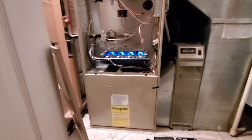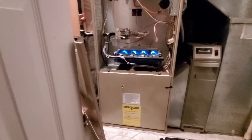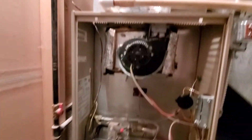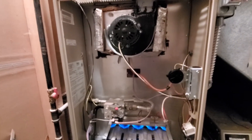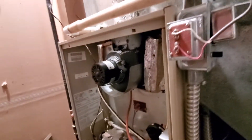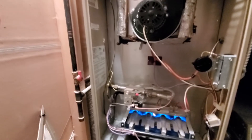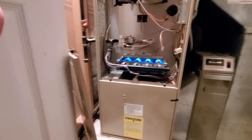If you're having this problem where the induction motor spins constantly and pushes cold air through the house — not the big motor, the little induction motor up here — if that's spinning continuously, you have a bad circuit board and need to get it replaced. Consult professional help, but in a pinch this switch can be actuated manually. Turn your thermostat up, make sure your fused switch is on, and while that induction motor is spinning, pinch that tube and it will fire the furnace until it reaches temp. Then you'll have to go back and do it again.